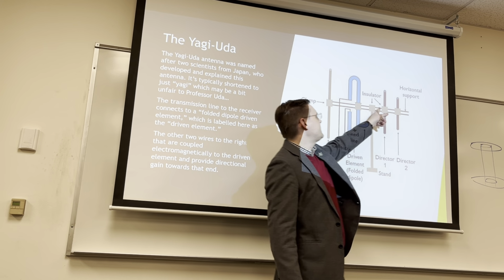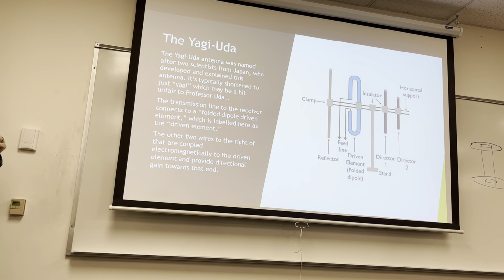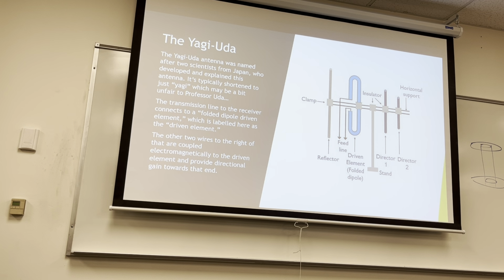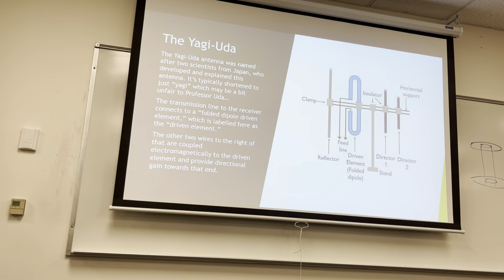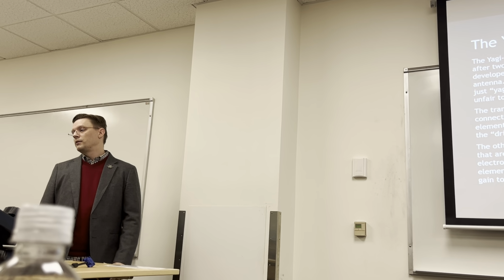And then if I space these off at particular intervals, it reflects in the way the geometry works. Again, I'll put the video up. It's a 5-minute watch, but it explains it really well. If I have these reflectors at these particular points along the curve, it folds that in even more. Now I have a really pointable antenna, and if I move it physically around, I can scan for something that I'm looking for. So the directors are limiting.